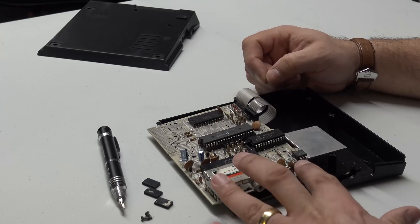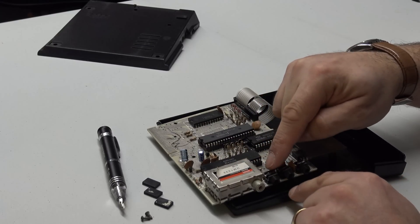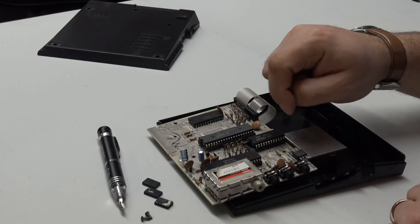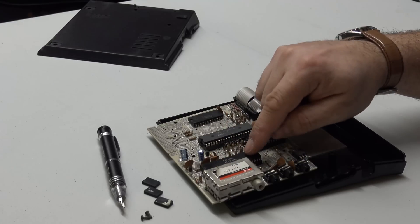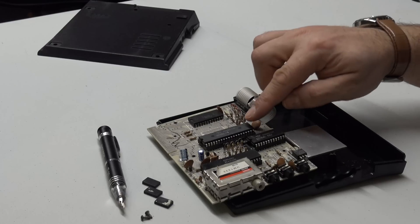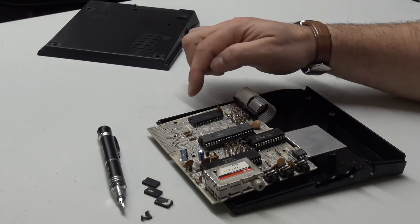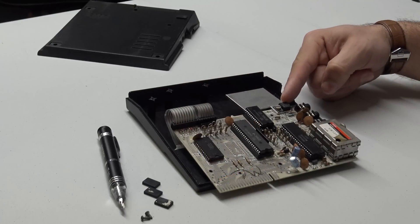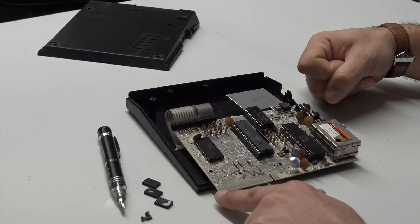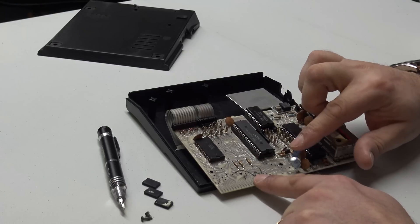When you do lift off the PCB please be careful — you might easily fracture or damage that ribbon cable, as those plastics tend to get quite brittle as they get older. Looking over the PCB, here we have the UHF modulator. Here is the input, output and power supply sockets. Then here is the Ferranti ULA. This here is the Sinclair Research ROM. We've got the Zilog Z80 central processing unit. The RAM is located over here. That's the 7805 5-volt regulator. And down at the bottom we've got a little expansion port where we can add some more memory and various other bits and pieces.